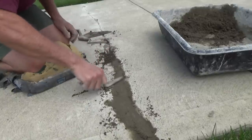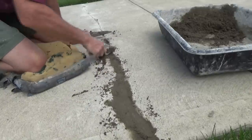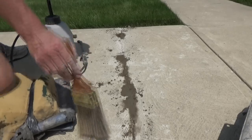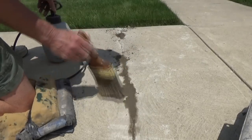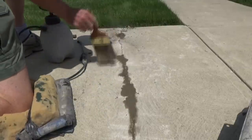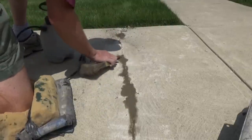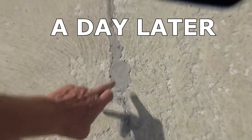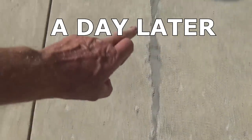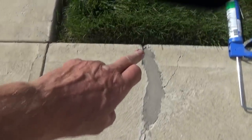You don't have to do anything fancy. I'm just dry packing it and brushing it off. It didn't leave any stains because it wasn't wet. You don't have to have it wet. I came back a day later and you can see this is all dried. Right here — that's the cement patch. And now I'm going to go over it with caulking.